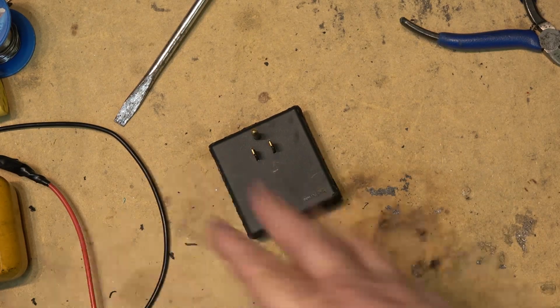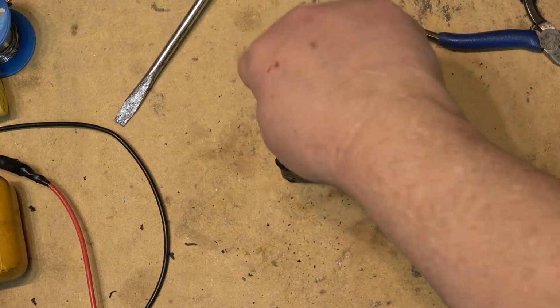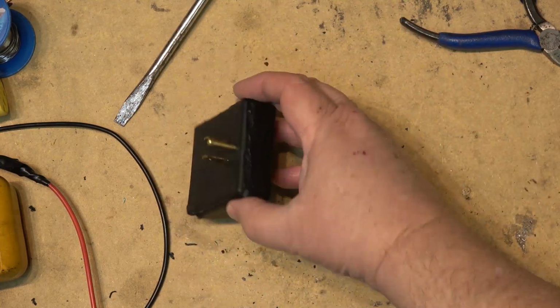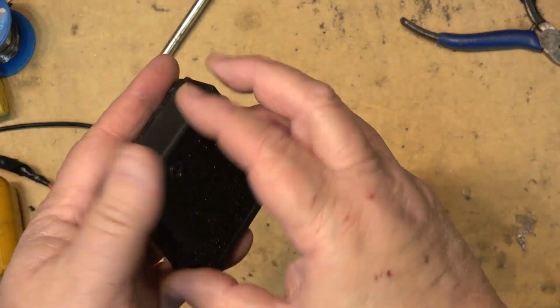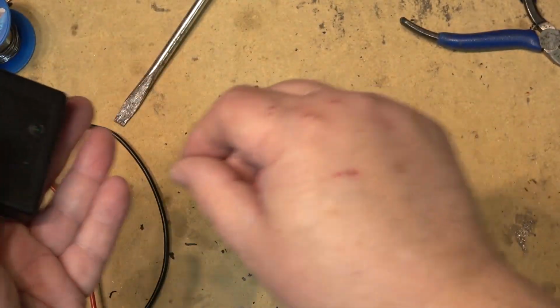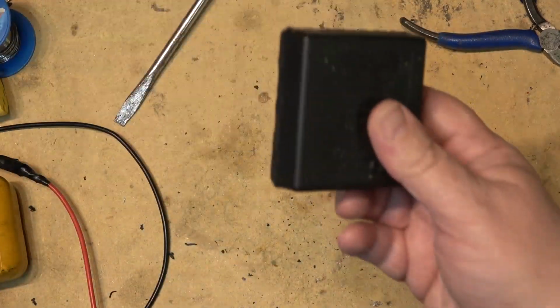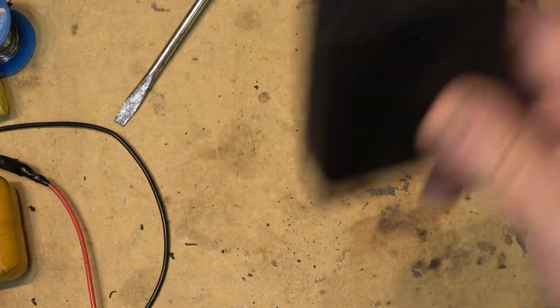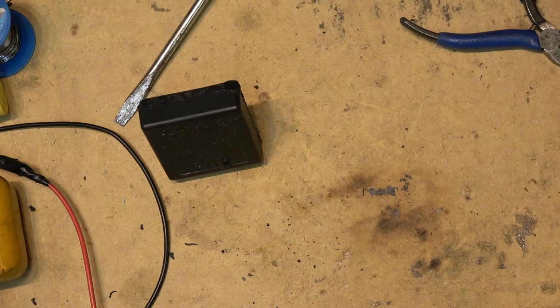And it's a good idea to have your appliances protected. Like, I have one of these similar. It's a single unit, but not only does it have this, it has an outlet on the other side, which is just straight through. I keep my washing machine plugged into that because, you know, all the new modern stuff, it doesn't take much of a surge to kill it. This one here, you plug it into one side of an outlet and then plug your appliance below it, right? That's how these ones would work. Plug it into an outlet, plug your appliance there, and this will protect whatever's plugged into that second outlet. Except for in my garage, it wouldn't work because my duplex plugs have two separate circuits. Top and bottom are on a separate circuit.